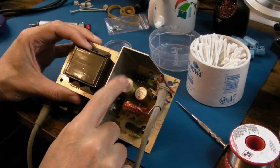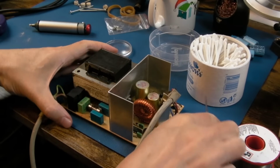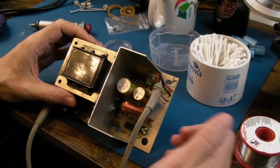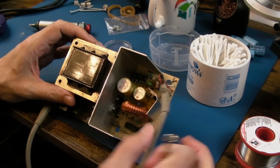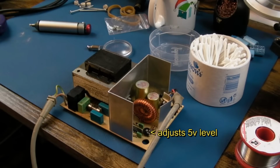Right, so I took that capacitor out as well. It was showing just over 2,200 microfarad and 0.01 on the ESR. There's no problem with either of those, so I just reinstalled them. I'm not going to sell this. I'll probably keep this as something for a C128 if I get one. So other than reassembly, I think there's not much more to do.